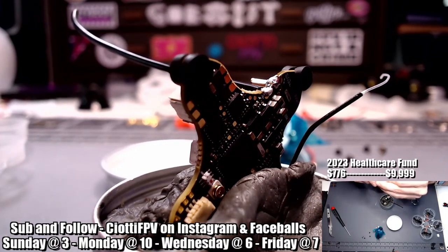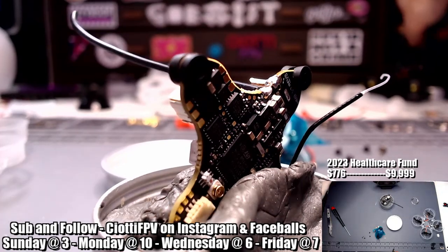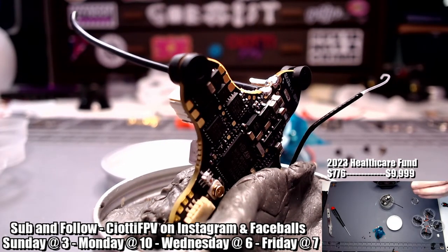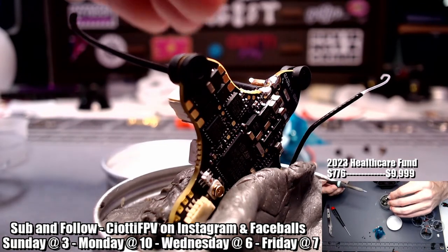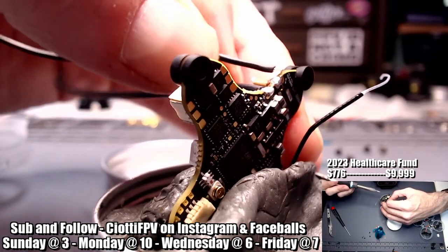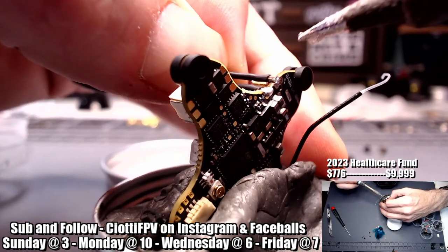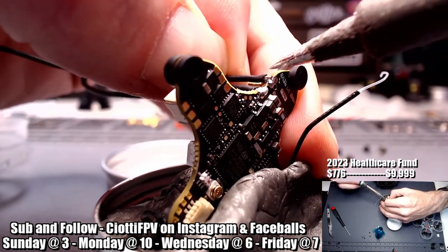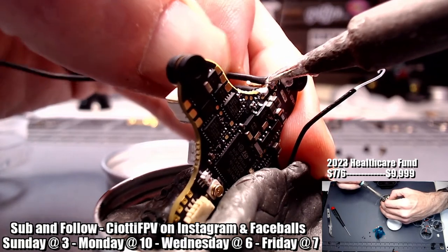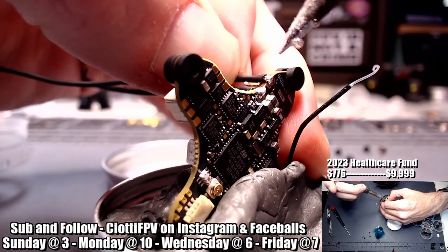Normally, you want to make sure that your offhand is doing the majority of the control of the wire. You don't want to rely on the tip of the soldering iron to hold the wire in position, because at some point you're going to have to remove the tip of the soldering iron from the work. And if it's the only thing that was holding the wire down, the wire is going to come with it, basically, right? And you don't want that. So